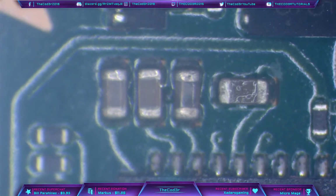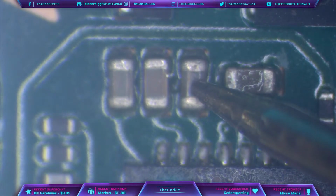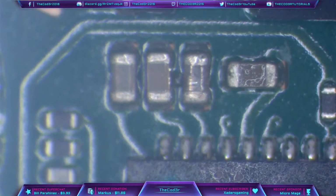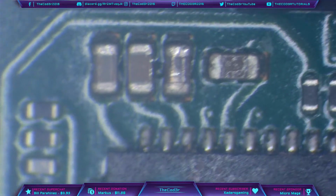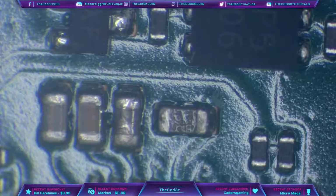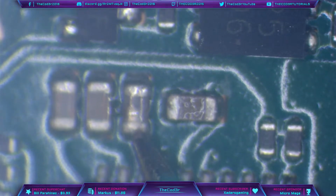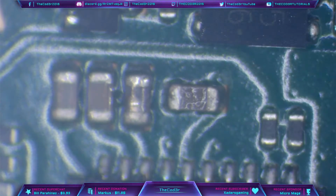We have discoloration on the capacitor, and the discoloration is underneath the film coating. So you've got a film coating over these caps. As you can see, I can scrape that away, and as we can see, we've got discoloration on the bottom. That's not actually coming across very well on camera when we're taking the film off, but we have discoloration. So we can look around those kind of areas for any kind of indications. But we can also look on the capacitors themselves by checking with the multimeter, and as you can see, we do have a short on all three of these. So unless there's a problem with all three of those capacitors, M92 is bad.